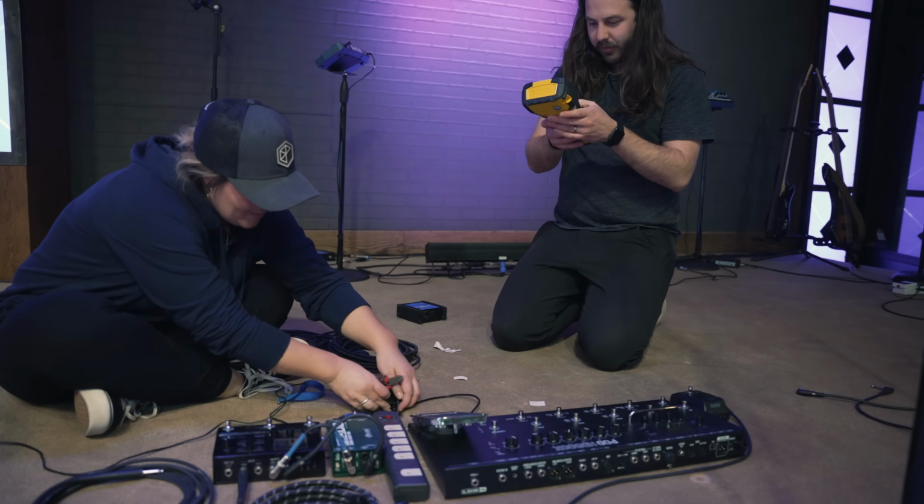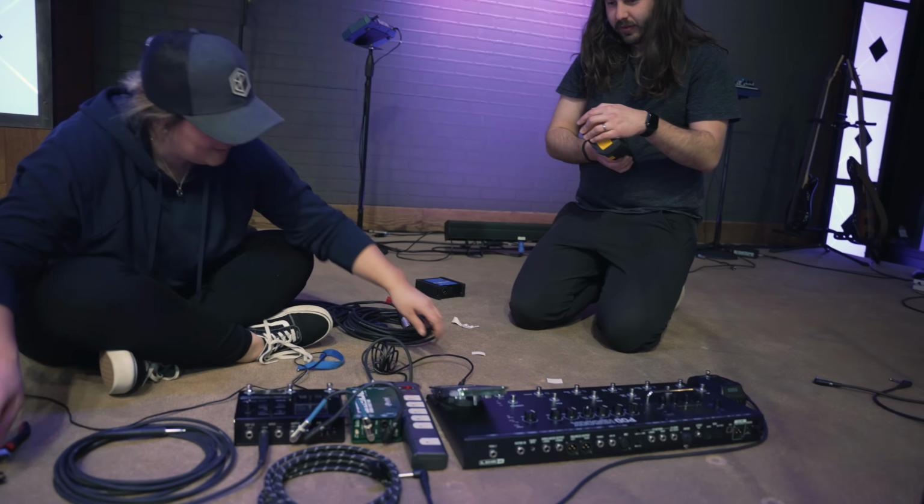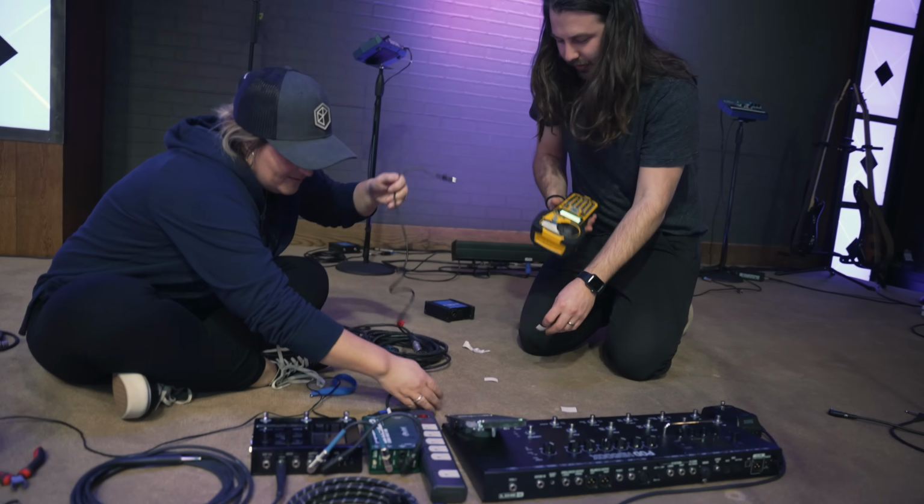So we were able to remove that amp because the people that played guitar were using something like a Line 6 Pod Go or a HX Stomp, and those have amplifier modelers in them that sound great. So we just moved those from coming out of the HX Stomp or out of the Line 6 Pod Go into an amplifier, and then changed it to 1/4 inch or XLR direct outputs and dialed in some amps on those modelers.